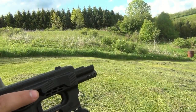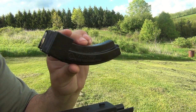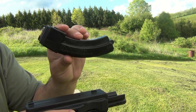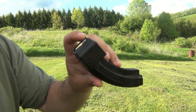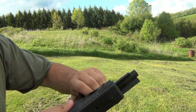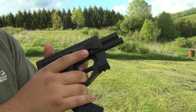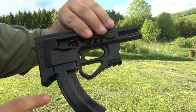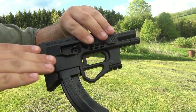Got another magazine — this is the Ram-Line 30-round mag. I only have these loaded with 10 rounds for demonstration and testing purposes. The spring tension should still be fine with 10 rounds in there. Put this in the gun, make sure it's locked in all the way. The problem that's been pretty consistent with this firearm is that if the magazine isn't seated properly, it skips over that round and doesn't load it into the chamber.